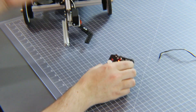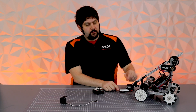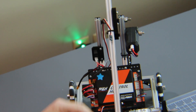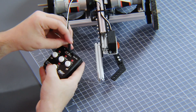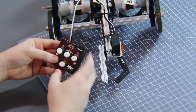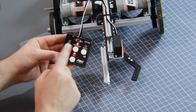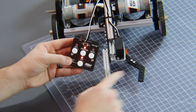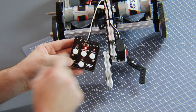Using one of our EDU bots, this claw is being driven by one of our servos. Unplug the servo cable that's going to the Control Hub or Expansion Hub and plug that into the programmer while it's still on your robot. Go to test mode, set the position to center — making sure left, right, and center work. Always start by setting your servo to the center position by going to the second test mode and hitting Program.